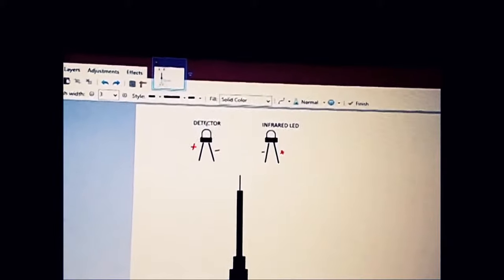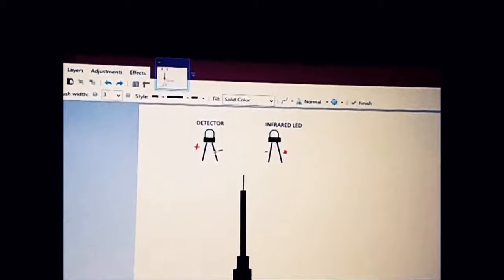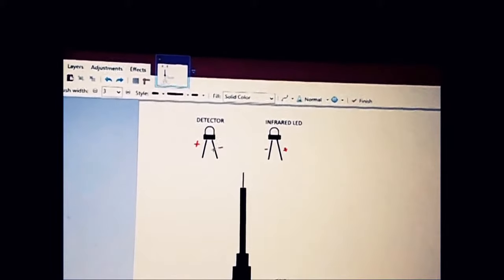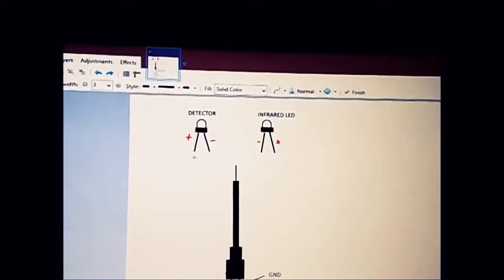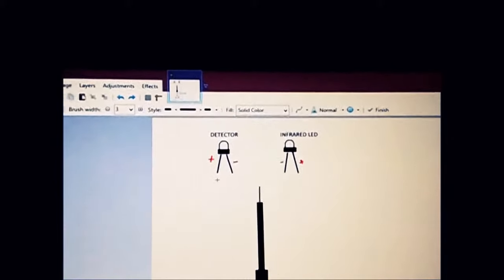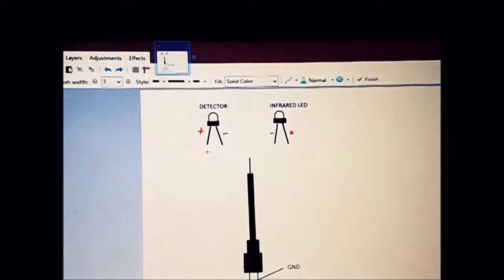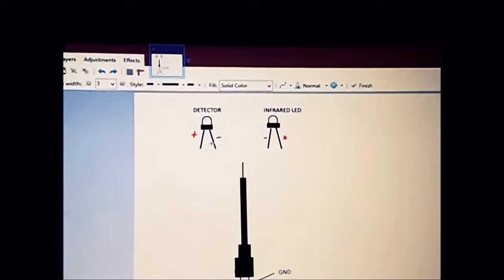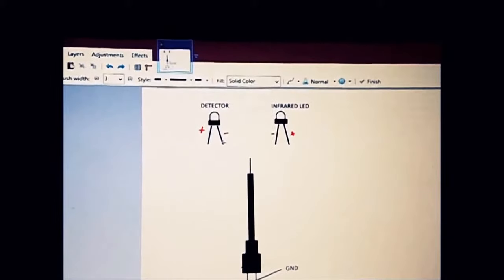Your detector, connect it as well to the multimeter, set to, let's say, 2 meg on your multimeter, and put the black one on one side and the red on the other side, and move it around in daylight, and you'll notice where you have a bigger source of daylight that the resistance actually changes. If you notice that, and your black one is connected on the multimeter on this side, red one on this one, then you have them the right way.